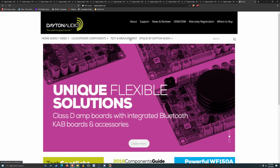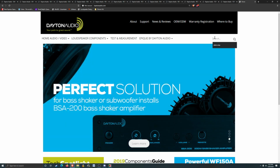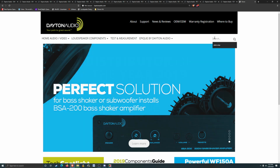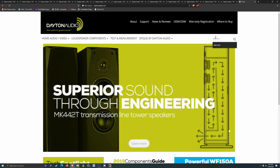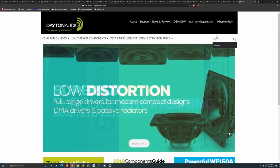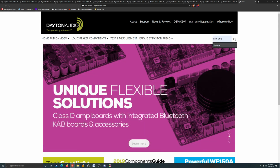For computer audio, you've got optical, you've got analog, and you've got HDMI, and if you're just doing a stereo set, HDMI doesn't really make a lot of sense, especially if you're doing a gamer setup, because HDMI is very reliant on the pass-through capabilities. If you have HDR and then 4K, 8K, and your amp doesn't support that, it could strip all of that off. So then it's kind of crappy.